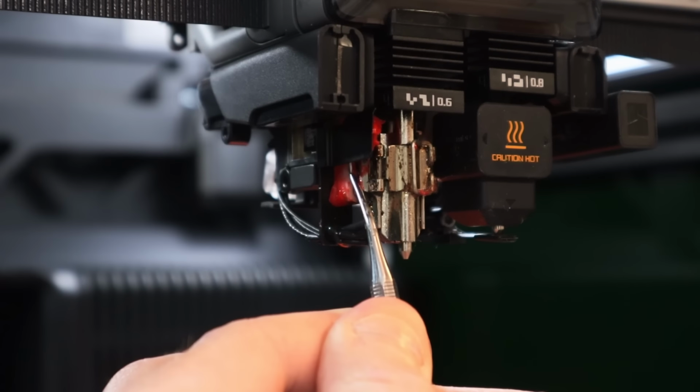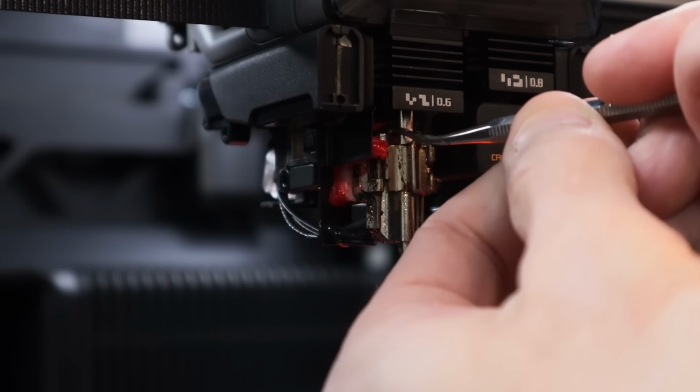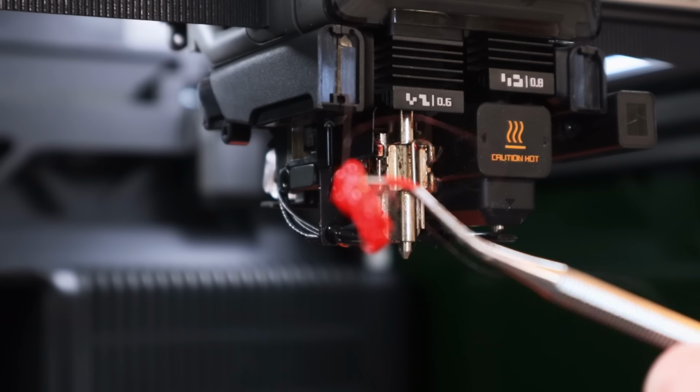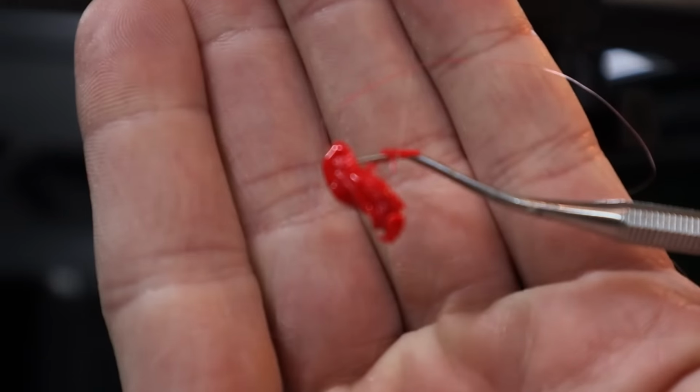I knew that using my older red basic PETG was causing buildup on the nozzle, but from my experience it wasn't going to be enough to cause a big problem. So what actually did cause the problem then? To keep this printer going non-stop, I didn't thoroughly clean the build plate when I rinsed off the detergent. Some residue was still on there.